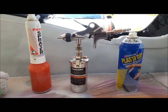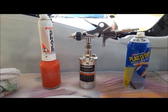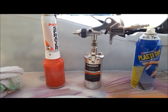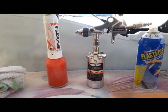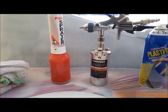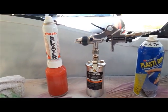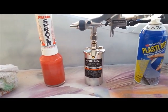I'm going to do a little comparison here. I'm not going to use the white plastic dip — I've just got it sitting there for size comparison. Just got the Husky sprayer, picked it up at Home Depot, it was $30. It's got a 1.8 tip in it, 600cc container down below, so it's not real big, but it's about equivalent — maybe a tad smaller — to the Prevail container. I've got red in the Prevail and in the Husky sprayer, pretty well adjusted. I've got my compressor putting out about 30 PSI.